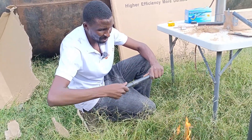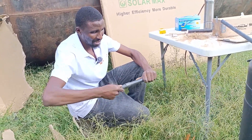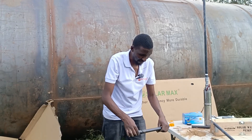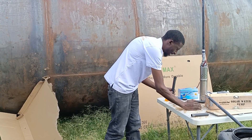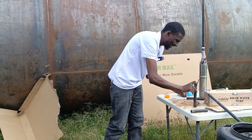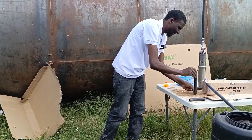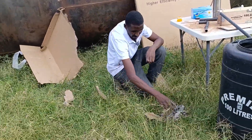This kind of pipe is no longer used in the water industry in most cases — we have the green ones these days — but for demo purposes this will work perfectly. What we want to do is get the water in from that side and let it flow back on that side. I'm also going to do a bend right here, so I'm going to add a little bit of sand so that I get a clean bend.